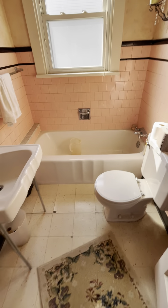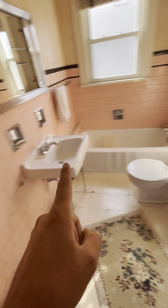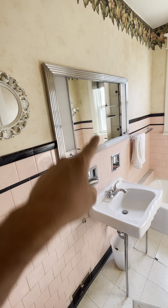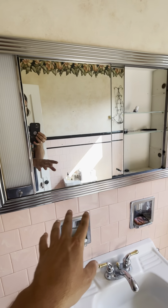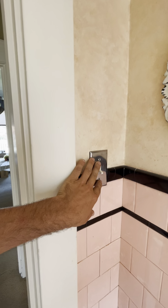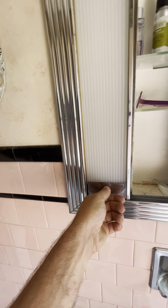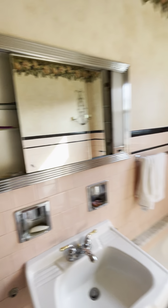Typical round toilet — we're going to put in a 24-inch euro because it's really tight right here. Then we'll do our 20-by-26 Pegasus medicine cabinet. Doug's going to put it in the recessed spot it's in right now, then we'll put our normal light above. We do need a GFI — we could do our switch with the GFI on the bottom, or they have power right here somewhere so we'll find a spot that makes sense. I'll go over that with Doug.